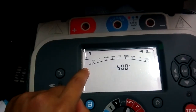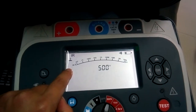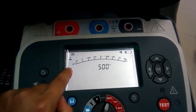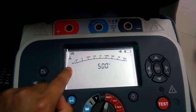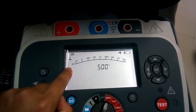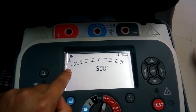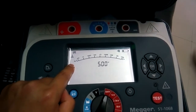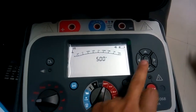You can see the symbol for breakdown mode. That means the testing of insulation will stop the moment there is a break of insulation, because if we keep on increasing the voltage, the equipment will totally break. So how do you go to the burn mode, which is quite a disastrous and hazardous thing to do?